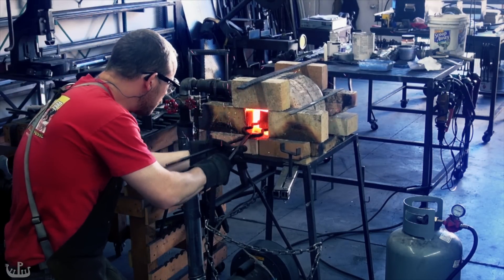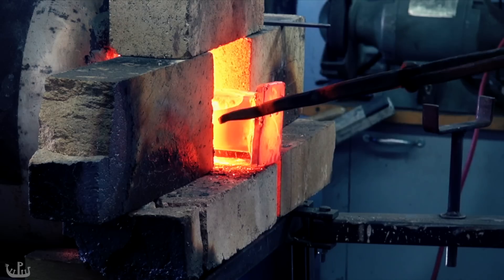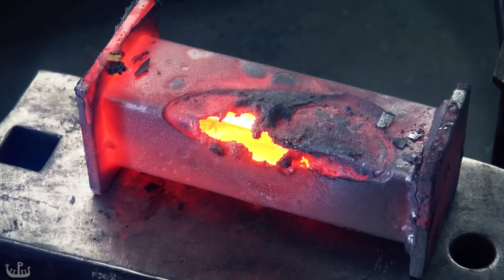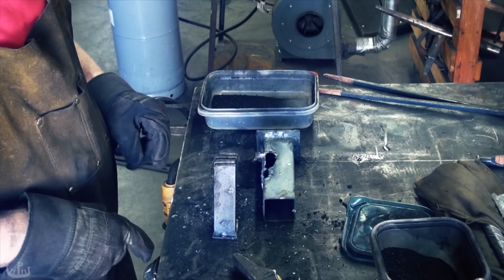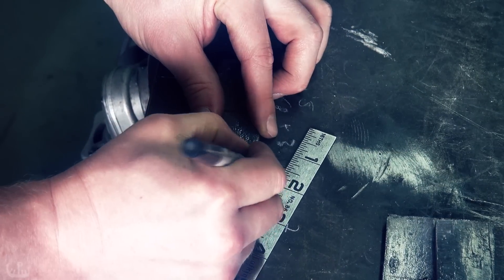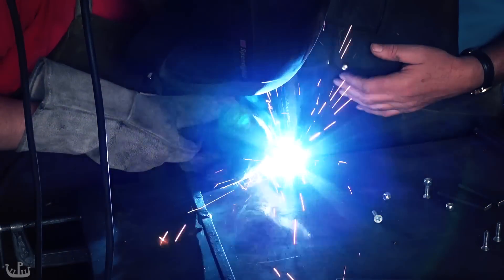I am using my gas forge as a heat source and need to dial the temperature down enough to not quickly destroy the container, because it needs to stay inside of the forge for several hours. This experiment was a failure and resulted in a containment breach — visually it is quite intriguing though. What I was expecting was a surface with a lot of visible blisters. There are some, but not nearly enough to indicate that the process was successful. However, I am going through the motions of stacking the pieces up and forge welding them. At the very least I can still use the material for another project.